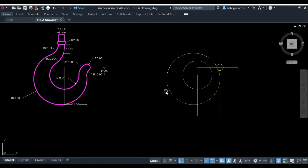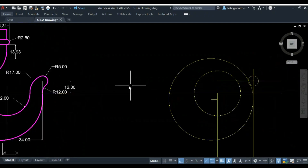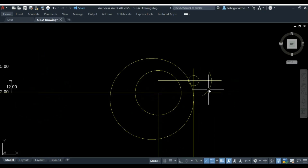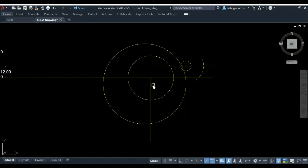We're now going to draw our first tangential arc, which has a radius of 12 millimeters. This arc is tangential to the 5-millimeter radius circle, so we add 12 and 5 to get 17. Using the center of the smallest circle, we draw an arc of radius 17 millimeters. The center of our radius-12 tangential arc will fall somewhere along that arc.